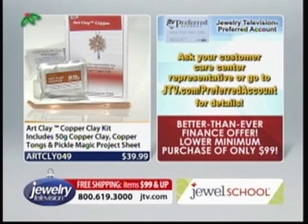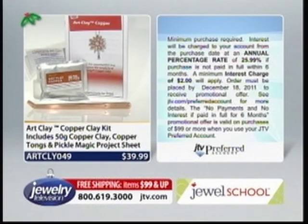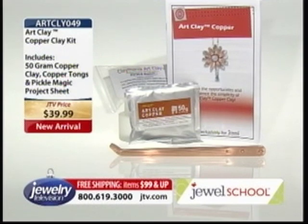And now let's ask you this. You've got the copper tongs in this as well. Really quickly, I've got to ask, why the copper tongs? Is that an important part of this? They are. We just talked about that in a roundabout way. You always want to use one metal at a time. Whenever you're pickling something, it's really important not to contaminate your pickling agent by sticking another piece of metal in.